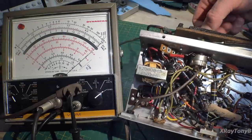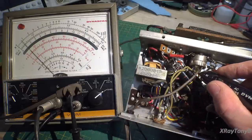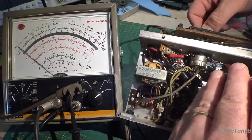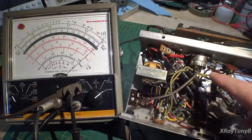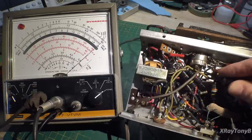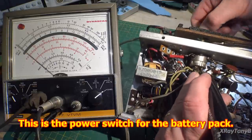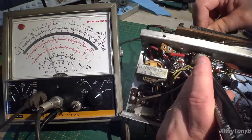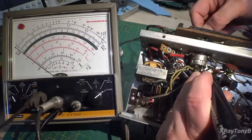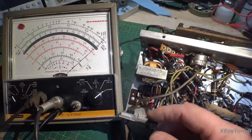Let's turn the radio on and measure through to see if the switch has continuity. And it does. There's another switch here — it's not connected directly to the mains, we'll look on the schematic — and it also has continuity. Good news: our power switch is good, that terminal is good, and our power cord is good.